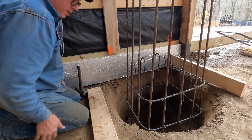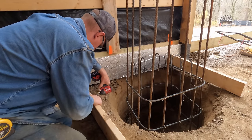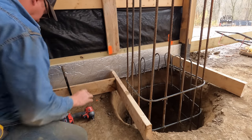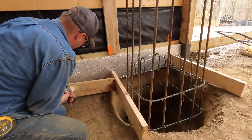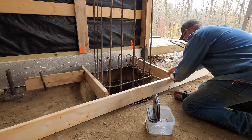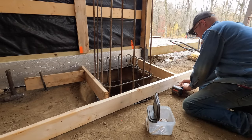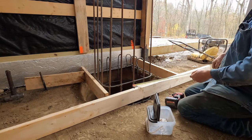Cave off part of that hole if I do that. I have to use a kicker board to get me away from that edge. One thing great about what I'm doing here is it's all just rough framing, rough forming rather. Nothing here needs to be super critical. It's just holding the top of concrete.